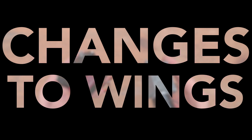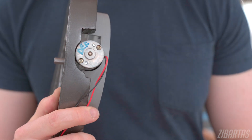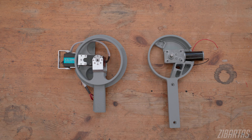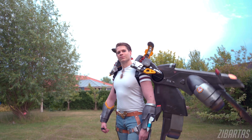That's just the price of being this close to the edge of what's physically possible with off-the-shelf components. These motors are clearly larger than servos, so the wings themselves needed to be slightly altered to fit them. Honestly, starting from scratch probably would have been easier than trying to make the old things work with the new mechanism, but I did come up with a way to use the old wings with the new motors. The most important part was to keep the point of rotation so the wings would move as before.